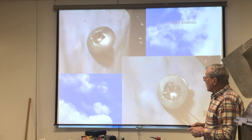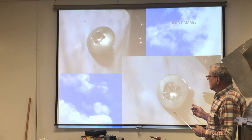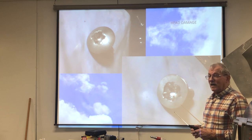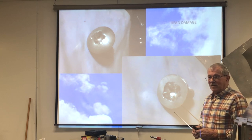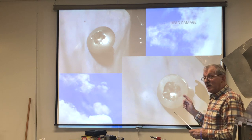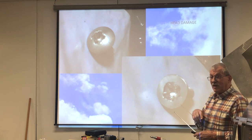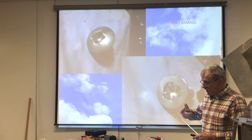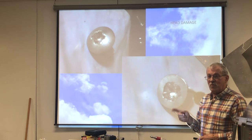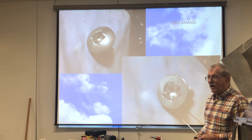When I put an airplane back together after an inspection, generally the Tinnerman sheet metal screws come out pretty easy. On all the nut plates with the machine screws in them, I'll take my oil can and put a little drop of oil. I'll go to every one of those four inspection panels on that Beechcraft. When I got ready to put the panels on, I put one drop of oil in each one of the screw holes, in each one of the nut plates, and the screws went right in, no problem.